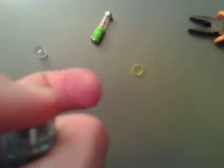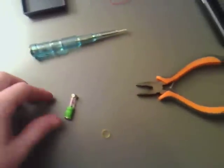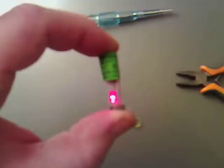Inside there there's a little yellow band. What we need to do is get the pliers, apply a little bit of pressure, and pull it out. Now the little band is out, and we should be able to just drop that out. We don't need the megaohm resistor, which is on the floor now. You'll find that this is now an empty screwdriver. However, we can put the top back on the screwdriver and still use it — you can even hide money in it. We've got the main module, and when I touch top and bottom, the light comes on. That's brilliant. That's the module we want to keep, and it's the one we're going to put inside the ion detector.